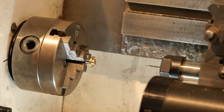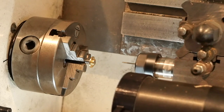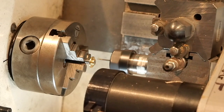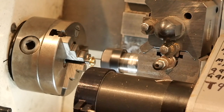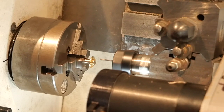So we'll turn on the tool post milling attachment — that's got a 1.6mm drill in it — and bring it into position. Now I'm going to send the instruction for the chuck to rotate around 180 degrees and drill the other hole.